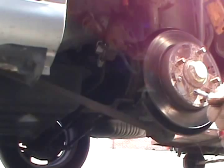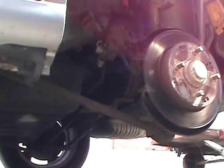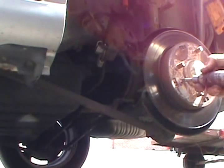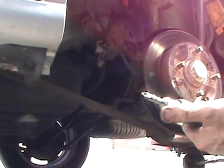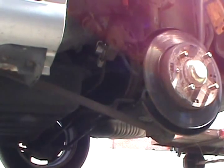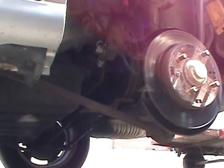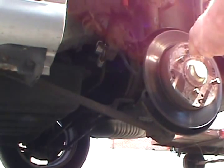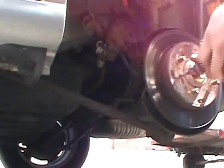This is how I've had most of my luck — with an impact screwdriver. This one's seen its days. A lot of people use the hammer method: tap it and then break it loose. But this is my fail-safe way. You're doing the same thing but you're actually putting the Phillips bit into the head before you smash it down. Sometimes after the hammer method you're already messing up the head. I made a couple of hits and it was loose.